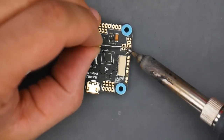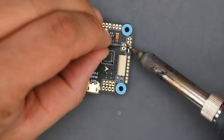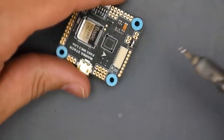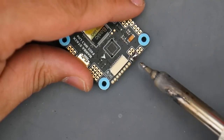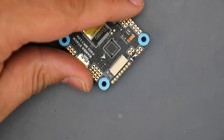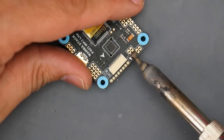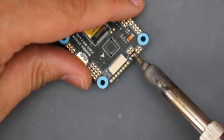And don't be scared to keep the soldering iron longer on the board. It's okay. As you can tell, we bridged, which is really nice, so I can show you how to fix that bridge. All you have to do is, if you have good solder, hopefully, just go like this and move down. Go like this, move down, clean the tip, and then just do the same thing again. So don't worry about it and don't stress it too much. There we go. And if you have flux, that'll help even better.